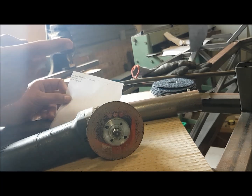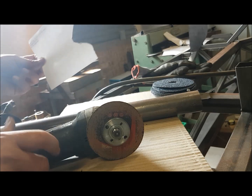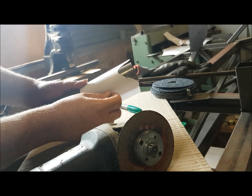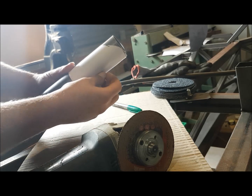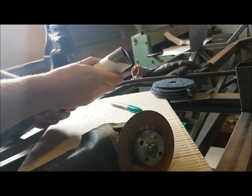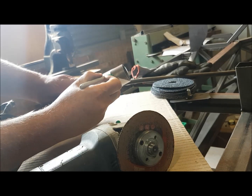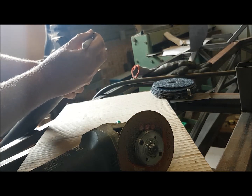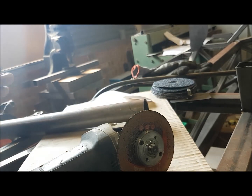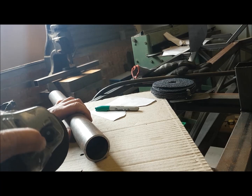In the program, all you have to do is put in what the tube size is, what tube size it's meeting, and what angle it's meeting, and it prints you this profile at the intersection. Then all you have to do is wrap it around the tube in the right place, transfer the profile over, and attack it roughly with the angle grinder with the cutting disc on.